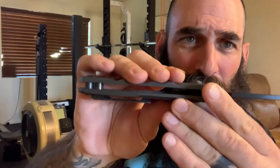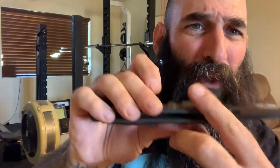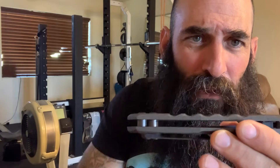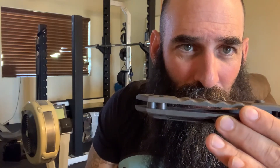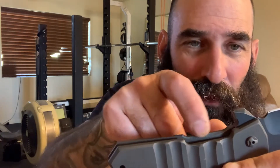It's somewhat precision machined depending on where you look. I don't know if you can see the height of that pivot — see how high that pivot screw is sticking up? That's kind of odd, like you could have machined that down a little bit. And if you look at these ball grooves right here, they're done — this part looks really good angle-wise, but he's chamfered all that stuff by hand. So it's got a little bit of that hand element into it too. Same back in here where they're chamfered.